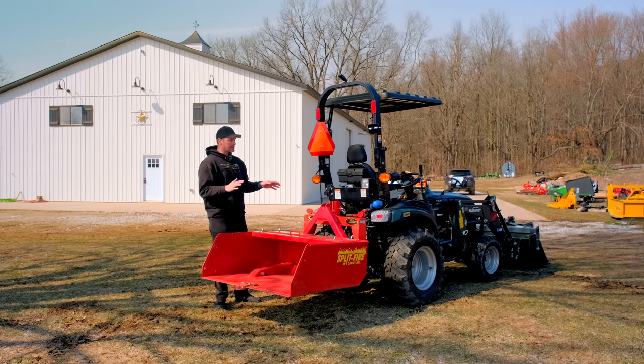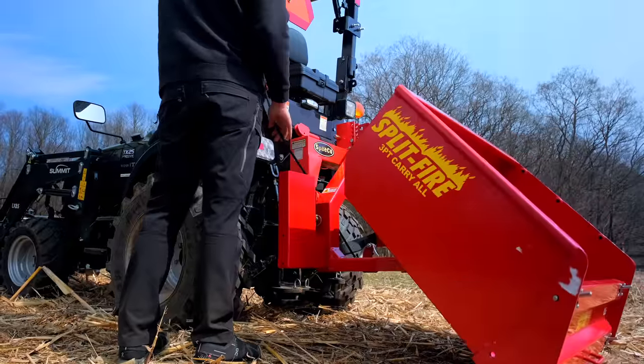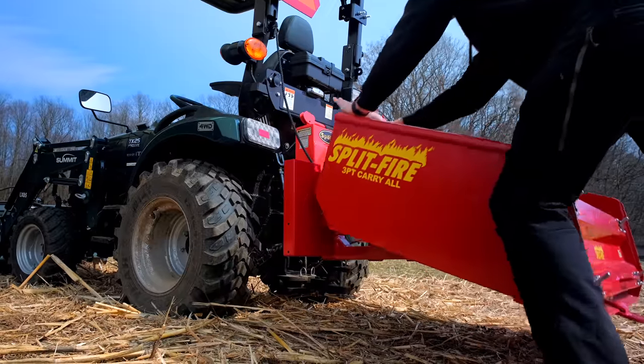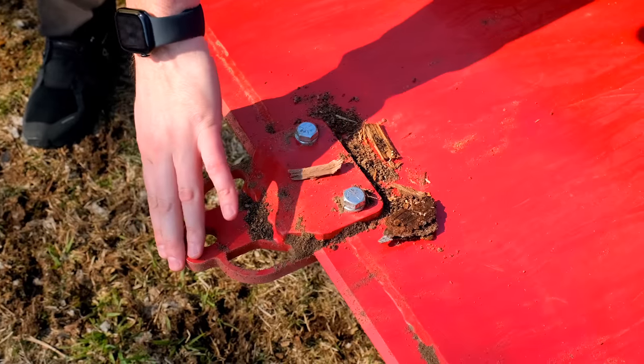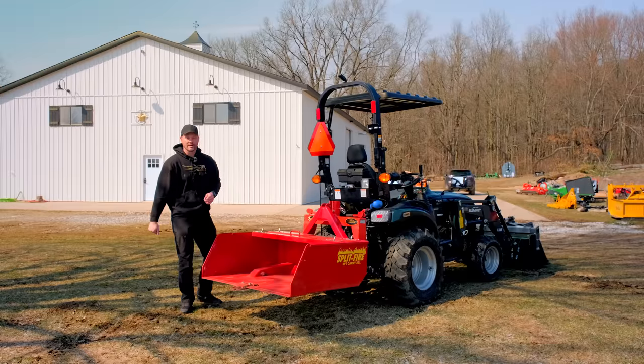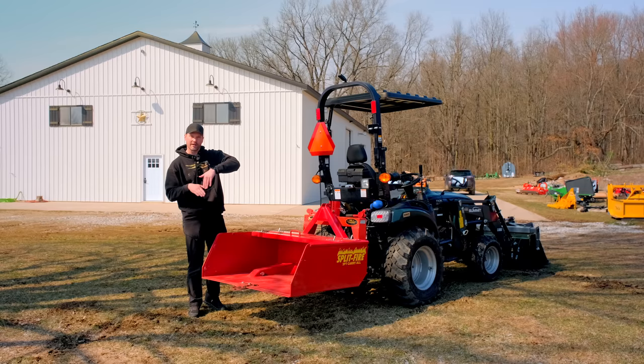And I think it'll work, obviously, for any size tractor. The smaller tractors that don't have as much lift height, they're not sitting as high, you're not gonna get as steep of a tilt angle, all right? So that's just a logical thing and a limitation of it. But also we have this ball, or the little hitch plate, on the backside too, and that's touching the ground first and also limiting our pitch or our angle.